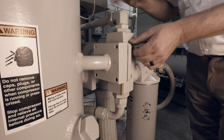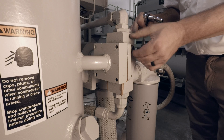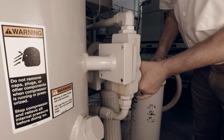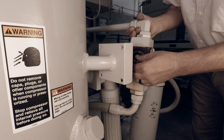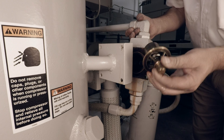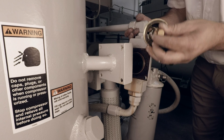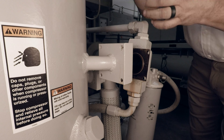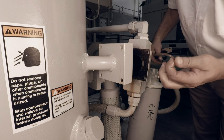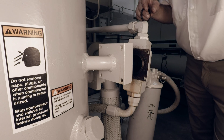We're going to remove these four bolts — I already have these pipes up here loosened, but I left them on to support the weight of the assembly when I swing it out. With all the bolts out, we can then pull back the assembly and we can see our thermal valve element. This is the thermal valve element — very much like the thermostat in your car — and once the oil temperature reaches a certain level, it will allow flow through the cooler to maintain a target temperature range. One thing to note is that some models use an O-ring for sealing and others will use a gasket, so pay particular attention when you pull it apart.